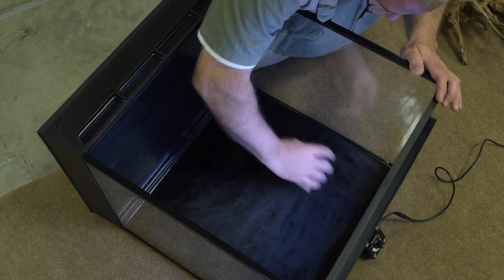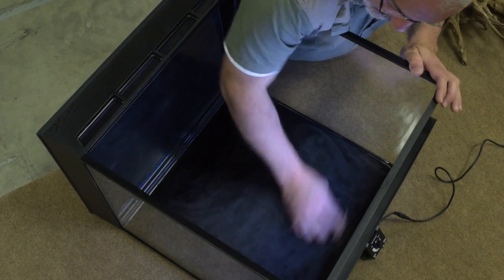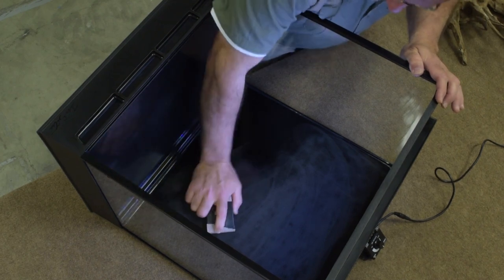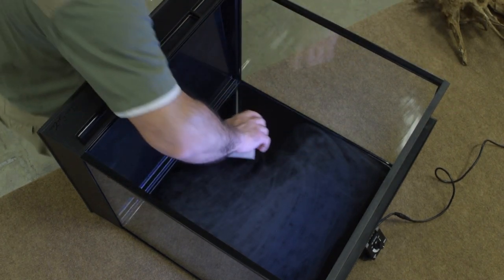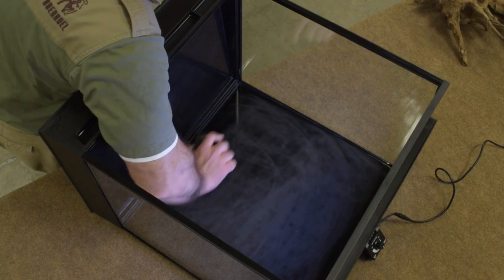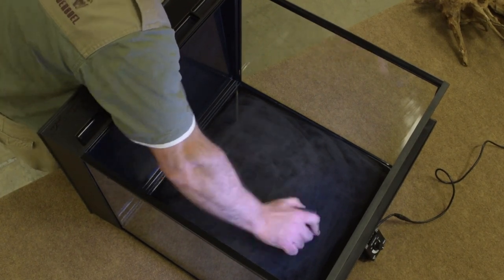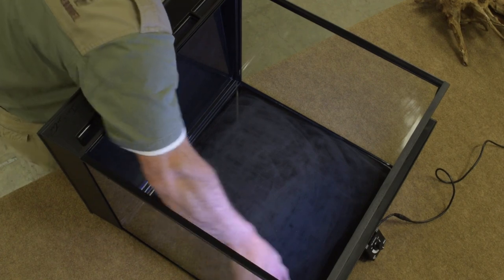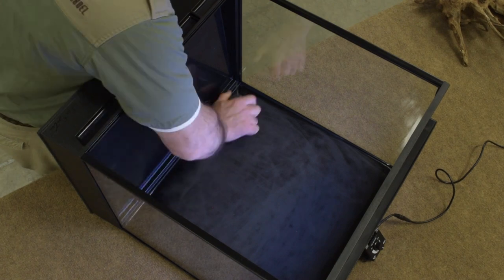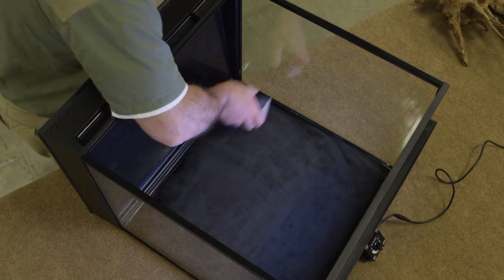This composite back panel material is really soft. You don't want to scuff it to the bare aluminum or to the primer. All you want to do is break that surface so that it's not shiny and that you have essentially created very fine grooves that increase the surface area as well as opened up a surface for a chemical bond. And so there we are, literally within just a few seconds, the surface is ready for bonding.